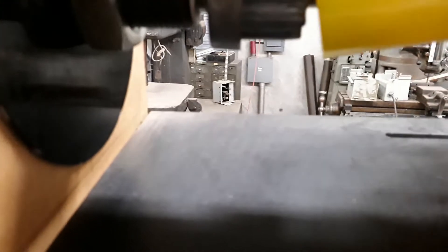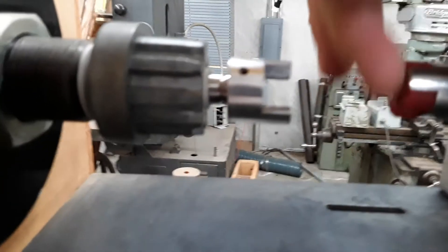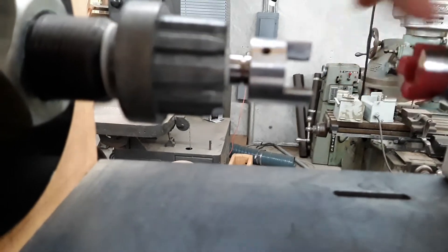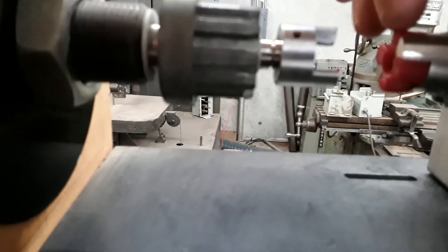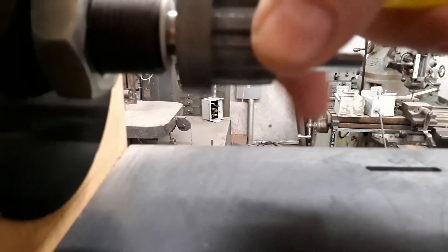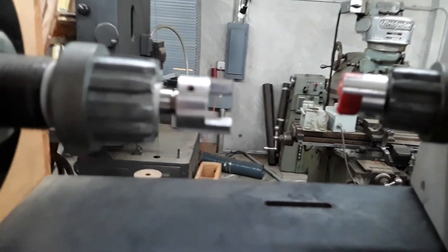A caveat: with the minute coupler there are only two positions you can get it in, and both of those positions are off by six hours. So it'll be either at 12 o'clock or 6 o'clock depending on how you put it in — make sure that's correct. You'll never be off by just a couple of minutes. That's different with the hour shaft, because it has a spline with multiple teeth. If you're off by one tooth, you can be off about 5-10 minutes. So make sure everything is set at 12 o'clock when you put it together, so you don't have to play with any adjustments inside the drive.